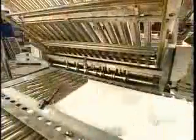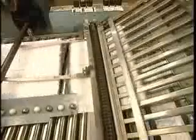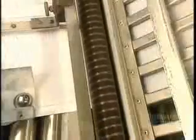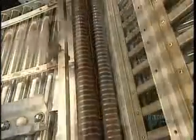Then the sheet moves along the conveyor belt until it hits a stopper to the far right. That stop position aligns the perforation between two rollers. Watch in slow motion how those rollers pull the page down, pressing a neat fold. This process repeats itself for each fold of the sheet.